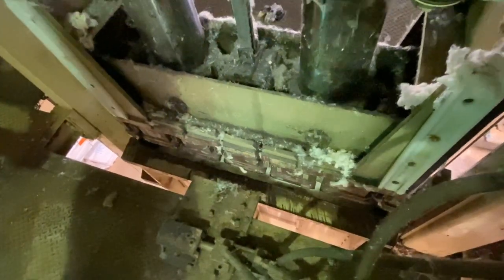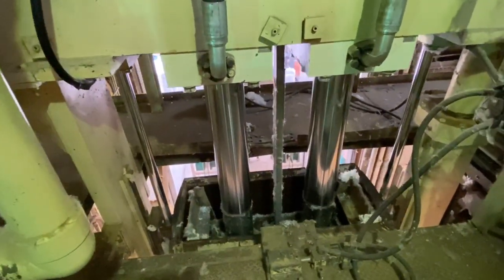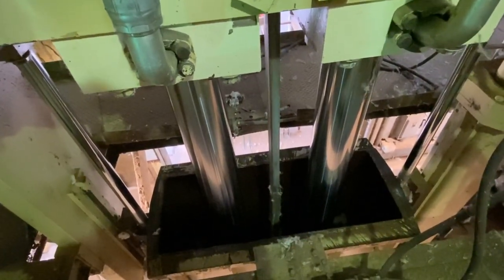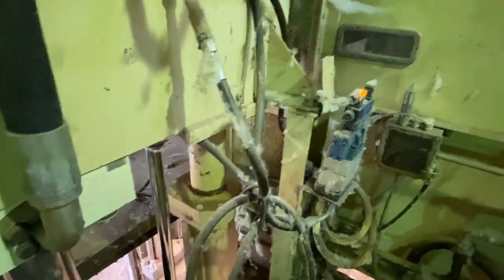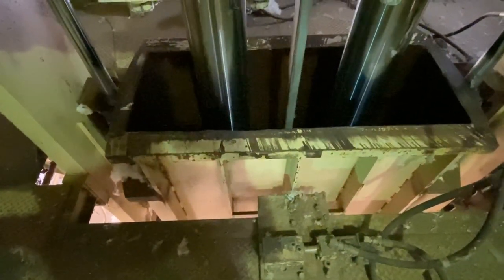There's the tramper, puts it into the press, into the chamber of the press. It gets until it's around 480, 490 pounds each time. And there it's twisting, and here go the cylinders pressing the cotton into the bale shape. I'm not exactly sure the PSI or the force that is pushed down, but it's quite a lot. Those cylinders are probably 12, 16 inches diameter, something like that.